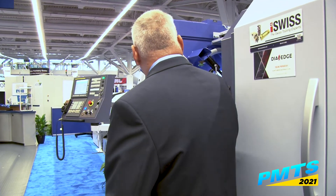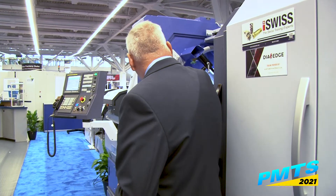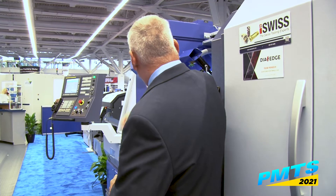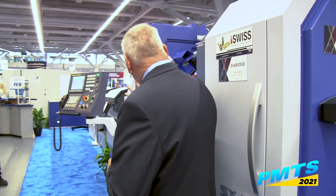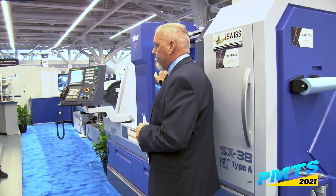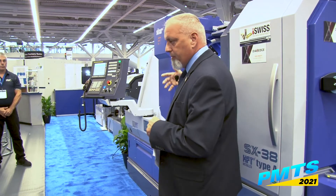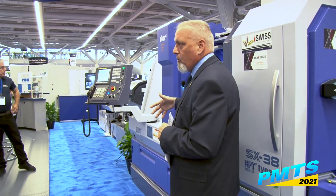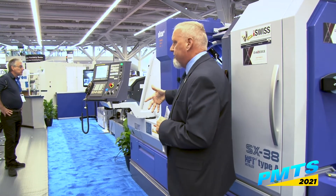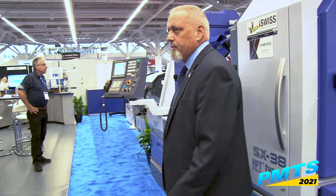Path one is our gang slide, focusing on chip flow. We have the bigger turning tools — four positions — and also a B-axis on the top. It's a built-in B-axis from zero to 135 degrees. It's four spindles ER20 on the front and four spindles ER16 on the back side of that B-axis arm, giving you half-inch capacity on the front and three-eighths-inch capacity on the back. The B-axis is fully programmable, so switching from cross milling to face milling is just a matter of what's in the program itself.